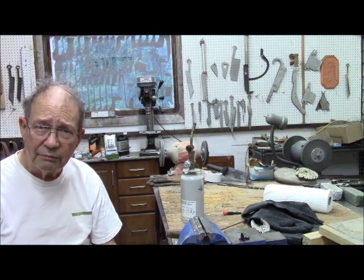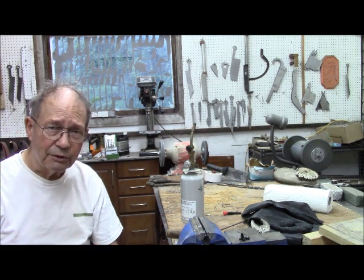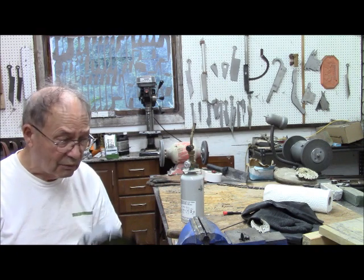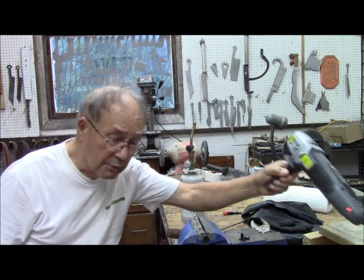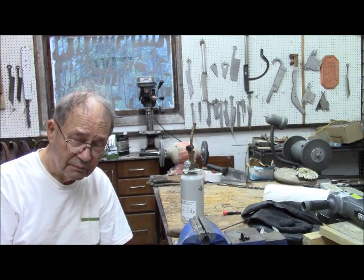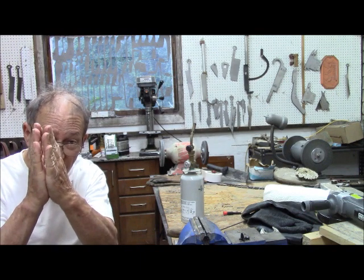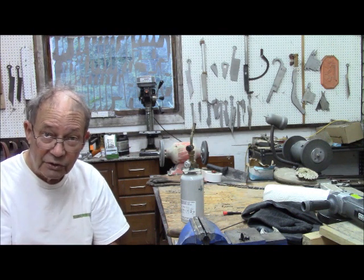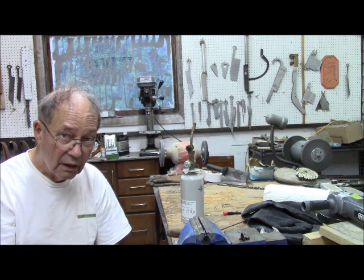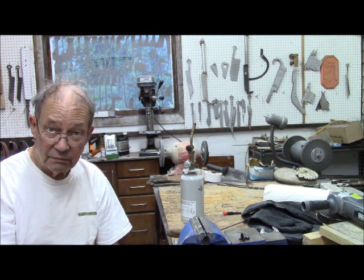I went back and got a familiar shop tool that many of you have seen me use — the angle grinder. Now, it is not usually wise to do precision work with an angle grinder on flintlock guns or any other, as it is a rather coarse tool. Nonetheless, I don't have a machinist shop, but I did have an angle grinder. That screw is very hard case-hardened steel, and it would cut it. I had to cut a slot absolutely very narrow, straight down through the middle, paralleling the existing slot and deepening it. A little bit of touchy, hairy work — we did it. Then the next time we put the screwdriver in that slot, it actually had enough purchase that it did break the rust free and screwed it out.